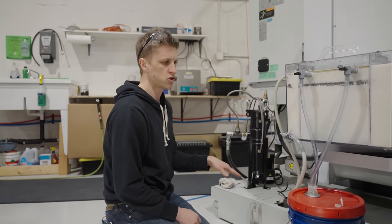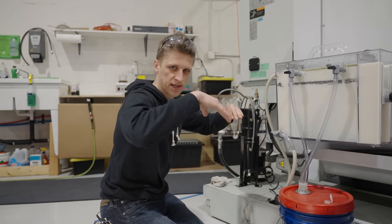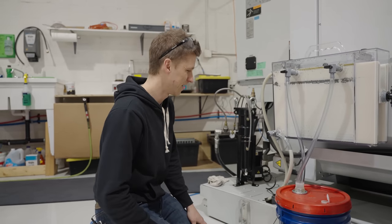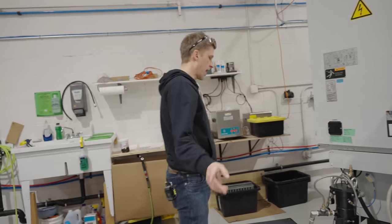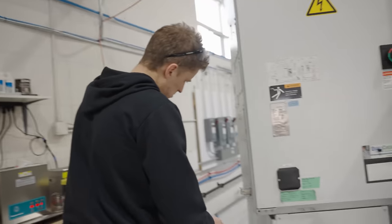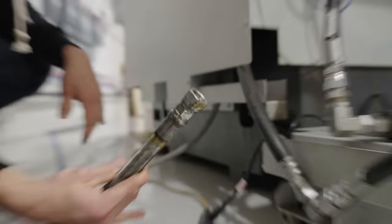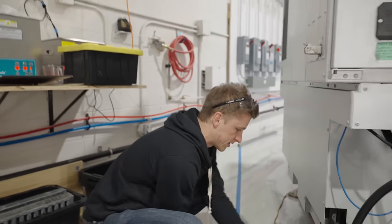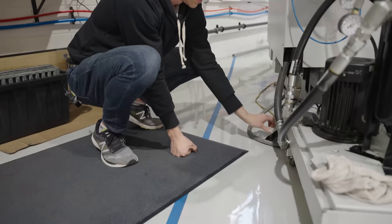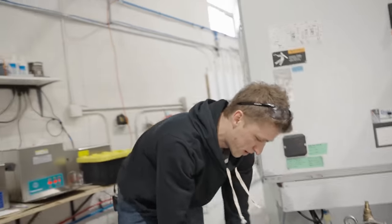I don't think there's a low-coolant alarm on this machine — I've seen the coolant coming out of the nozzles get really weak, which tells me I'm out of coolant, sometimes too late. The high-pressure coolant connection I mentioned is literally right there. If I put a pump on it at 300 PSI or more, I would have through-spindle coolant. I just haven't done it because sometimes I'm cheap and I'm not sure I need it that badly.